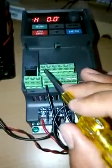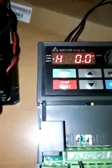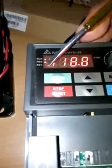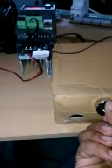Right now it's NPN, so I connected one terminal to common and the second to the input. Let's start — right now it's in forward direction but not in run mode. I push the button, and the motor is running in the forward direction with a frequency of 50Hz.